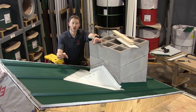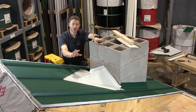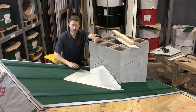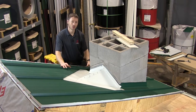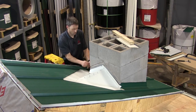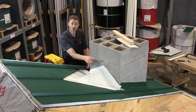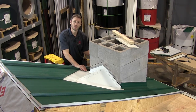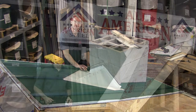Now we have all the panels installed on the roof. Everything is overlapping and locked in the way that it should be, and the next step is to install the final over-flashing around the chimney. We're going to install the front, then the two sides and the two back plates. We've cut a kerf or reglet on all sides of the chimney so we're going to insert our flashings into that. On the front of the chimney we're going to use a Z-trim and an end wall flashing; on the sides and rear we're going to use flat plates. Thanks very much for watching, and if you have any questions please reach out to your All American Steel rep or shoot us a note through social media.